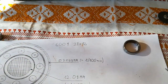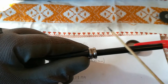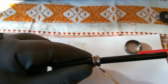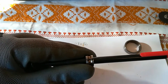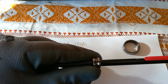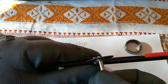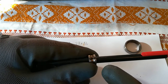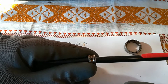Let's say that on this shaft we have an inner race that is stuck — you cannot get it out. You tried everything like normal ways, like heating it, and it's just stuck. So how do we get it out? Well, it's simple — we are going to cut it off with a Dremel cutoff disc like this one. If there is no important surface here or here, you can use it like this. When I say important surface, I mean things like surfaces for other bearings, maybe O-rings or some kind of rubber seal — important surfaces.